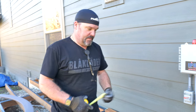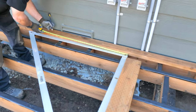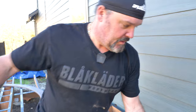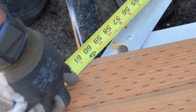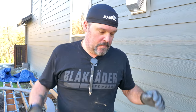Now just to double-check my method, let's go. We're going to measure from this point three feet this way and put a mark on the board. Then I'm going to measure four feet this way and put a mark on this board. When I measure from that mark to this mark, I should have five feet. Not bad — now I know that this line of this board is square.